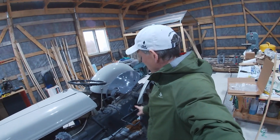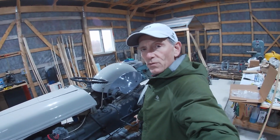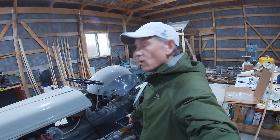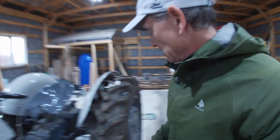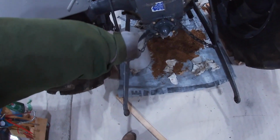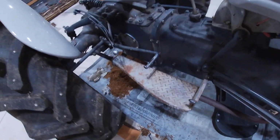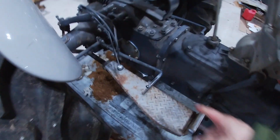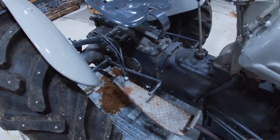All right, all the major work is done. All the covers are back on. The pump itself is reinstalled from the bottom. All the bolts have been torqued. The side cover's on, torqued. And as we come around to the back side here, the shaft is back in and that's torqued up. So that's essentially the double check to make sure that we've done everything, or that I've done everything. There's that seal that we didn't take off, sorry, the cover that we didn't take off.